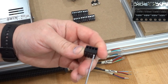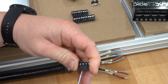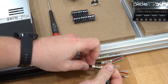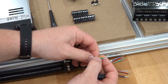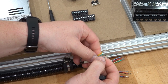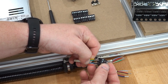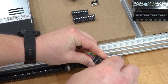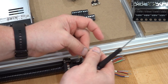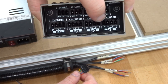Insert the X motor wires — red, blue, green, yellow — clamp them down, and double-check that wires are fully inserted. The X motor connector plugs into the X motor section of the Black Box. Moving to the Y1 motor: same exact process, insert colors as done with the X motor, and plug into the Y motor section of the Black Box.